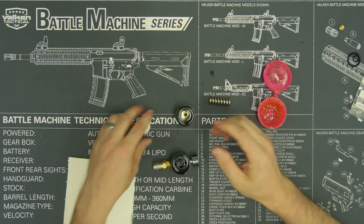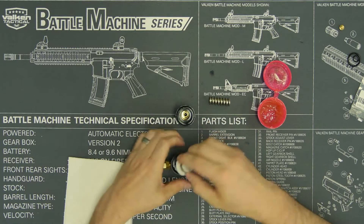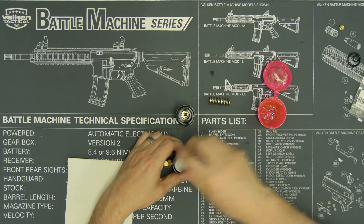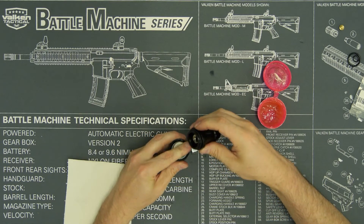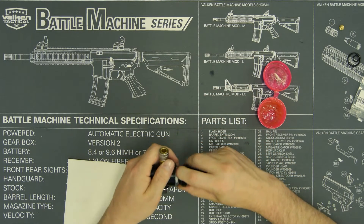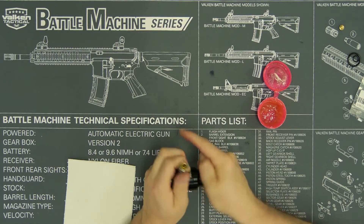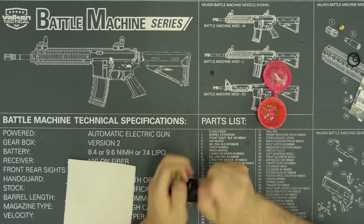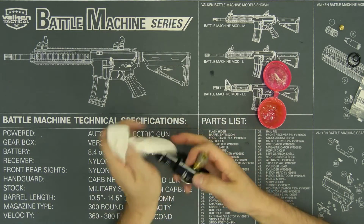Go ahead and take the base, put your spring and your spring guide in. This little part here with the crown goes down into the lower housing. Then you can put your spring and your cap where your adjustment screw is. Just be careful not to crush or pinch the o-rings, because if you nick them it will start to leak and you'll have to replace those seals again. Wipe it down.